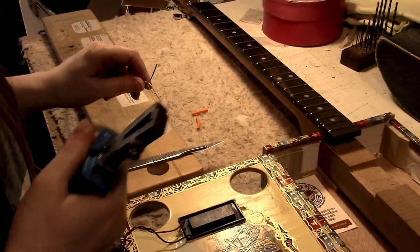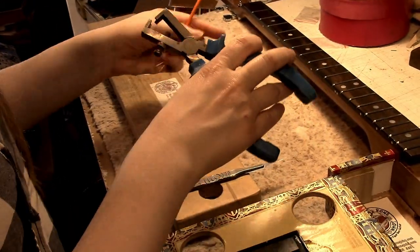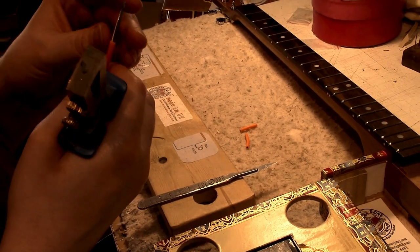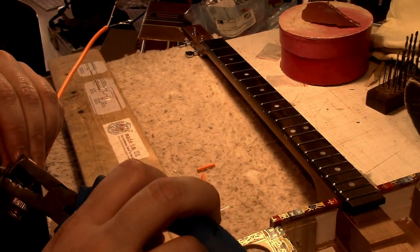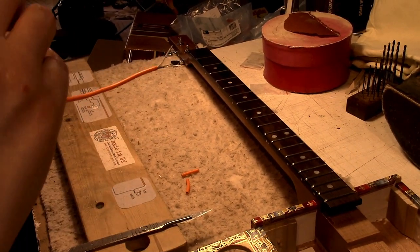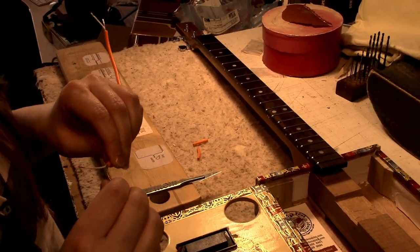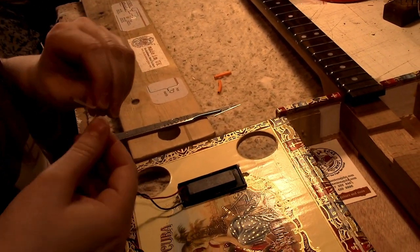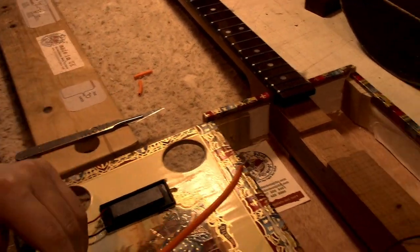I'm using a simple scalpel and rolling the wire underneath to get the outer casing off. You'll want to strip the end of the white wire and strip back most of the blue. When you strip off the outer insulation, you need to be careful not to cut through the inner insulation on the inner wires — it's very easy to do, and that could cause a short circuit. There is a bit of a knack to it. Then twist the bare shield and the stripped blue wire together — that combined wire will be your ground or earth.